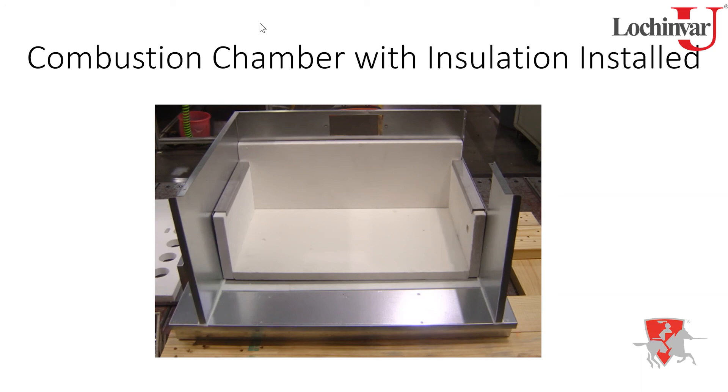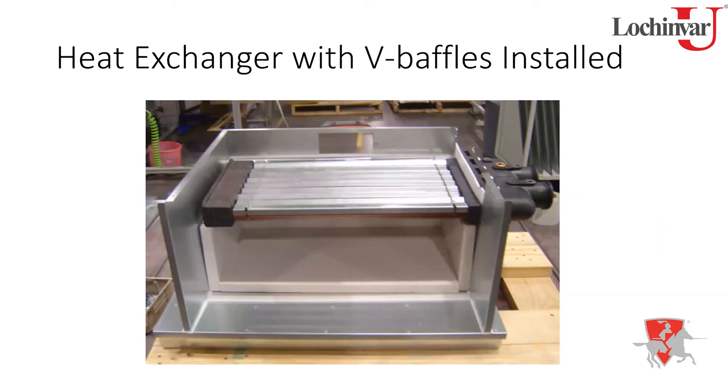Using a pressure washer inside the cabinet is not a good idea — avoid that. On the right-hand side of the installation you'll see a hole for the sight glass — not actually glass, but a material that prevents flue gases from escaping and gives you a viewport into the combustion chamber to see the igniter and burners in operation. There's also a U-shape where the heat exchanger sits down into the unit.